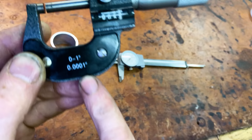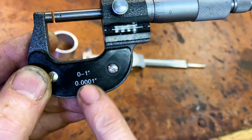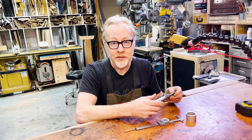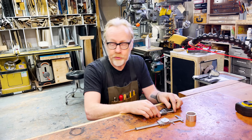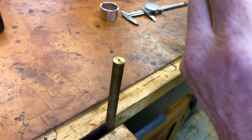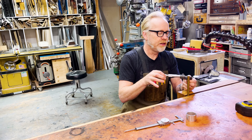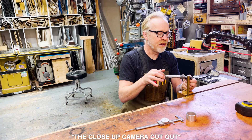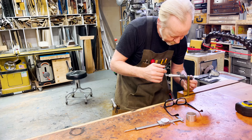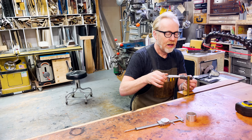This is specifically for measuring between zero and one inch with an accuracy of one ten-thousandth of an inch — 0.0001. This is a great tool. The free spinning of this barrel is super important to the proper running of these. So you bring this over to it, torsion it down, and it says — look at that — exactly half an inch in diameter, half an inch plus about four tenths of a thousandth. And that's how you would use these.